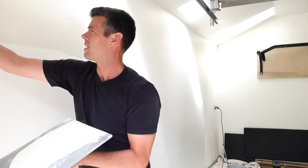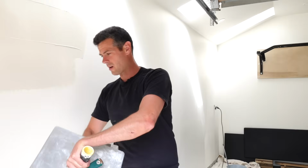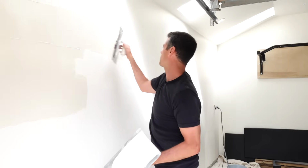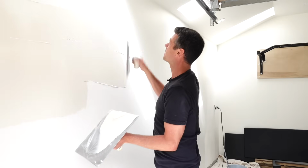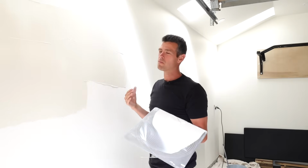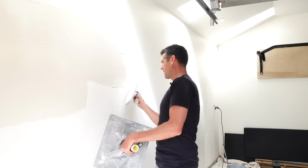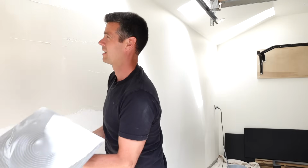And now you guys, as much as I would love to keep the camera rolling and show you all the skim coating and stuff, we've got enough videos about that and I do like to try to stay on topic. You may notice that I'm going horizontal today. Like I said, I just felt like because I did two passes vertically that it wasn't quite flat enough, and because all of the light in this place shines down, it really shows it if it's not totally flat on a horizontal plane. Whereas in most cases, you usually just have light coming from the side showing if you have stuff that's not even on the vertical plane. Anyways, that's why I'm gonna be skim coating this whole thing horizontally this time, just to give it that extra little bit.